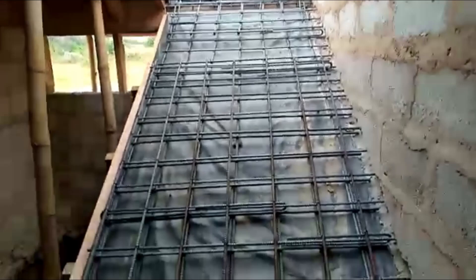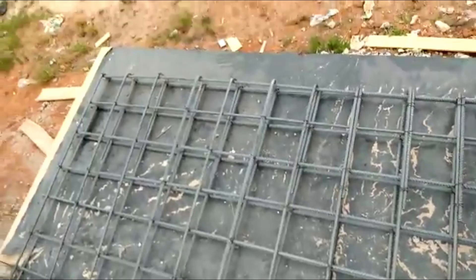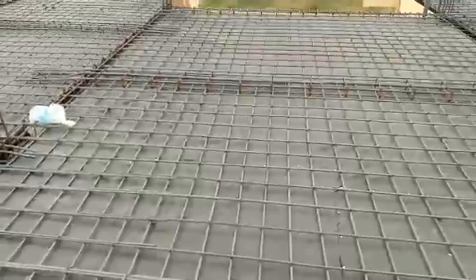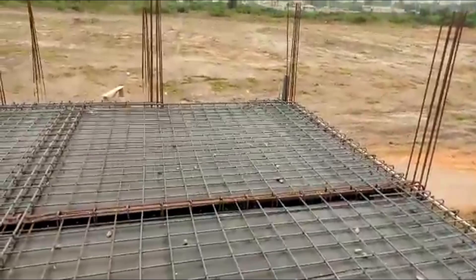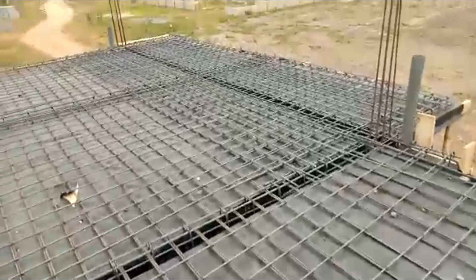This is a four-bedroom house. This is the base of the staircase - once you are having a hanging staircase, the steel bender should do what we call a double mat, or double mesh. Double mat is the name people know it by. Wherever the span of the rooms are wider, there should be secret beams running through them in order to avoid sagging of the concrete. As you can see, the steel bender did double mat including that of the secret beams - all the thicker ones you see are secret beams.